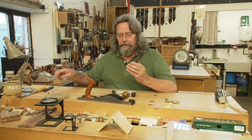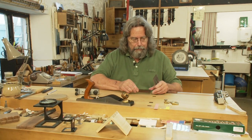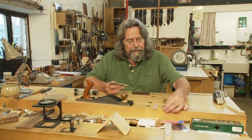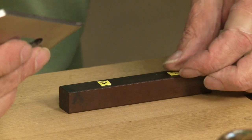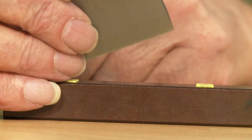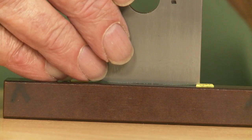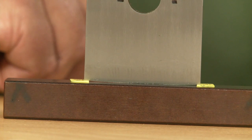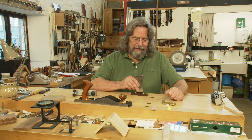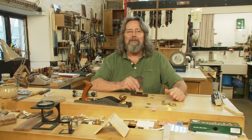I've got here my little bit of flat plastic and I checked last night and I found that I had created a camber with more or less twenty thousandths of an inch under each side. That's five tenths of a millimetre, half a millimetre, and that's a great deal more than I put on my bench plane. So in a moment I think we should go to the machine and have a look at what it does.